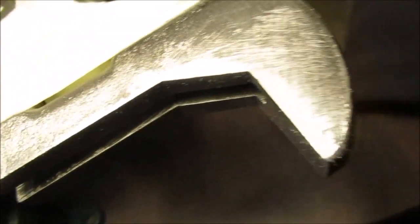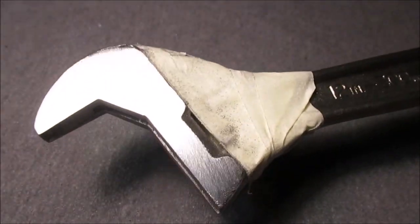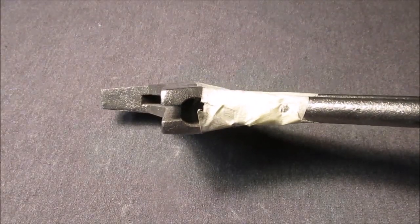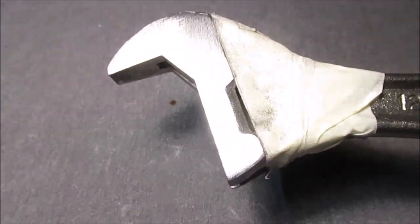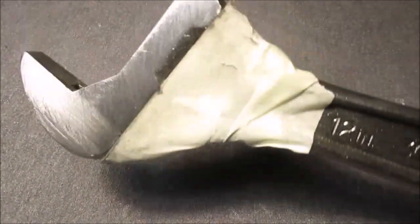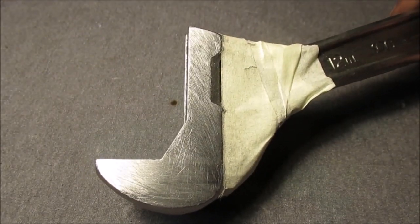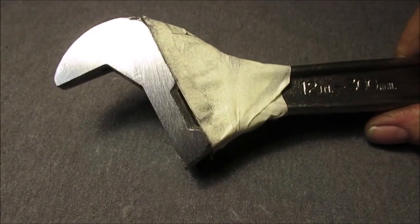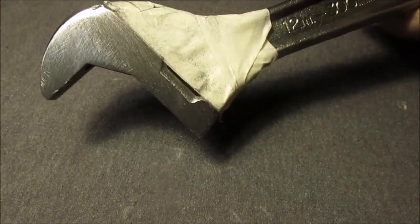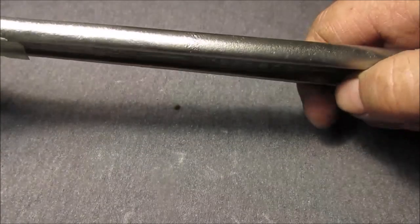Okay, we're all done. It kind of goes downhill there — I had to take a lot off back here so I didn't take anything away from the front. Now I have to figure out how to get the file marks out. I see no pits left — there may be one or two, but no one's gonna notice but me. That's the factory look — see how these are made? It was ground and polished right there. The rest is gonna be this natural surface with whatever pitting from the rust.